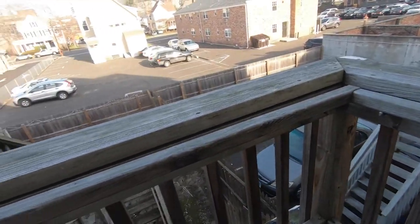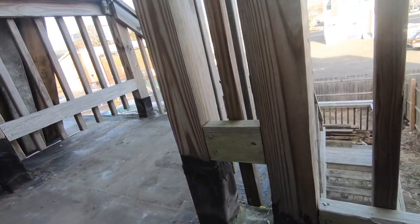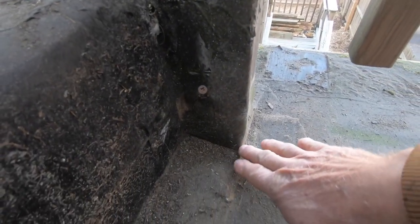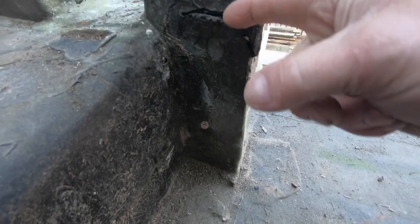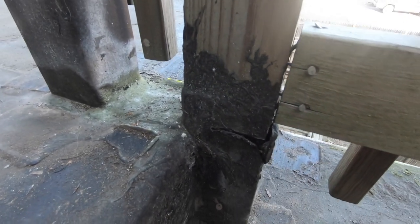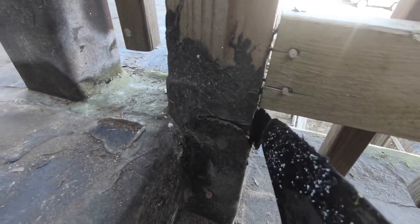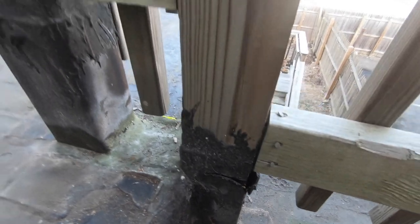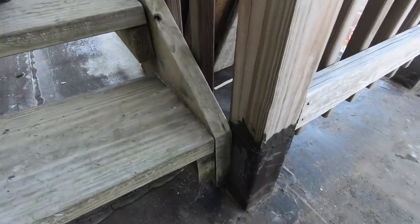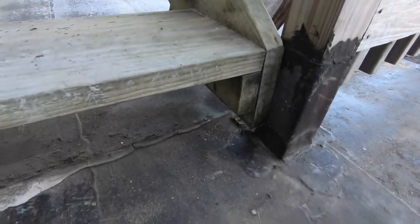You've got railing and columns. Look at this — they brought the roofing up to the column, but you cannot do that. How do you seal that? See that? Absolutely wrong. Same here. That's not good. That's the second problem.